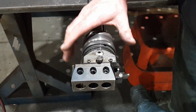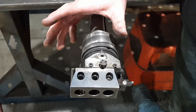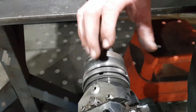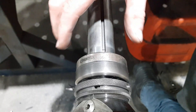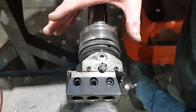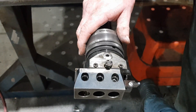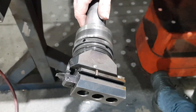A lot of people have commented on this particular device — this is actually for a milling machine. It's an automatic boring and facing head, but we use it on our line borer for cutting snap ring grooves. I made the bar from a piece of 40mm with a 5mm key cut through it, then adapted an R8 Arbor — machined it down and machined the bar down for that to fit inside. There's a bolt that holds the flange into the bar, then we just bolt the Vertex boring and facing head to that. This is by far 100% better than the standard snap ring cutter Sir Mechanica supplies with the machine. This can also be used in a milling machine for boring, facing, tapering, so on and so forth, but I've adapted it for cutting snap ring grooves on our line boring machine.